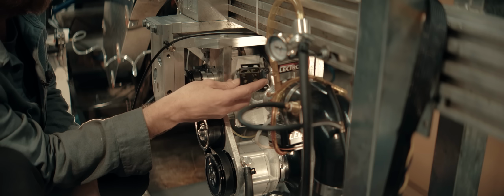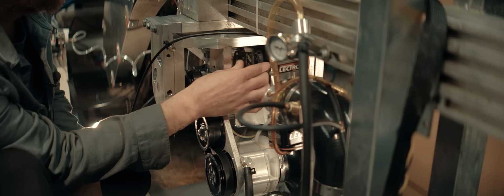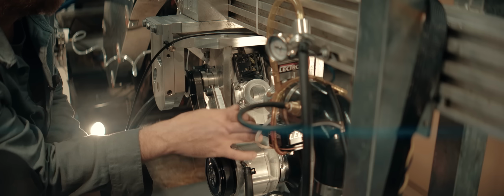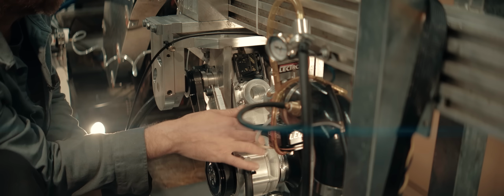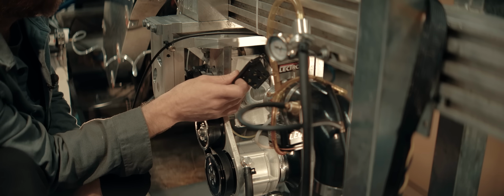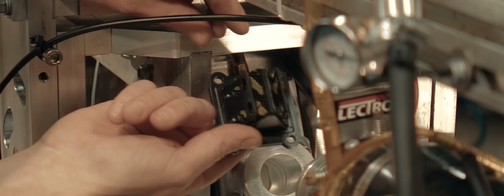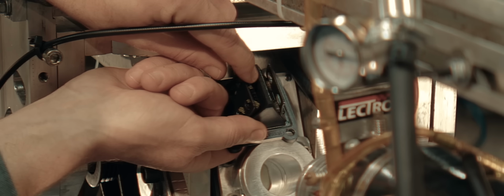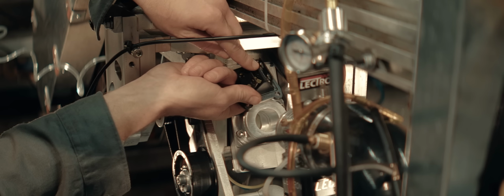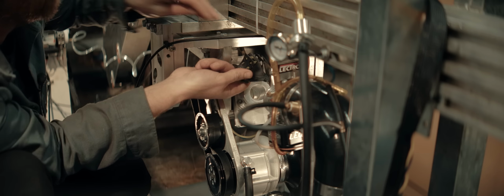The reason we're not using a normal reed valve, but this slide out of the way variety, is it's not needed with the supercharger when there's enough airflow from that supercharger. There isn't at low RPM. We need a reed valve for starting and low RPM operation, below the power band. The reed valve is a restriction in the system. And also, the reed petals have a resonant frequency. They will oscillate and behave in all kinds of different ways, depending on shape, stiffness, and how long they are.